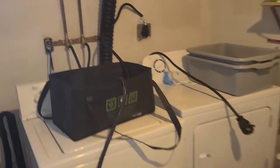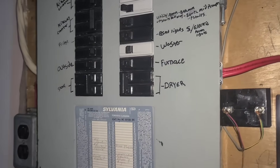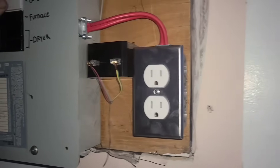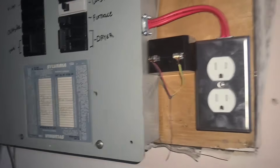Now that is 30 amps and I need to be careful of what I'm running. I know full well I'm not going to be able to run my microwave while I've got my furnace going — my lights here and there will flicker — so it's all dependent on what I have to have running. In a quick storm where power is out five or six hours, all I'm worried about is heating the house and keeping my food from spoiling. The deep freezer is going to stay cold and frozen for about a day and a half to two days. If necessary I can always flip off my refrigerator, turn on my washer slash deep freezer socket for a few hours, and turn the fridge back on after.